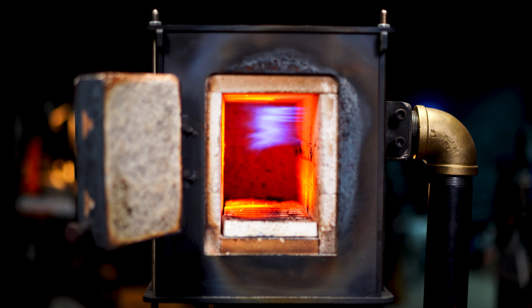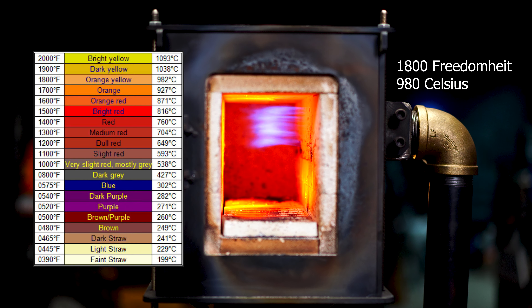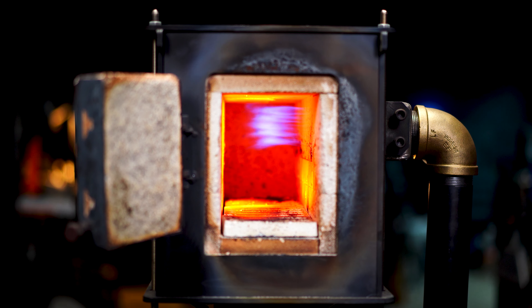You can hear the forge start to come into tune with itself — the flames are flowing at a nice rate, not being disrupted at the tips, a nice even burn all the way across. This is where we sit for normal forging work. Once I close this door and let it sit for about 10 minutes, the interior will be around 1800°F — that's where I want to be for manipulating steel, getting it to cherry red, then hitting it with a hammer, power hammer, or press.